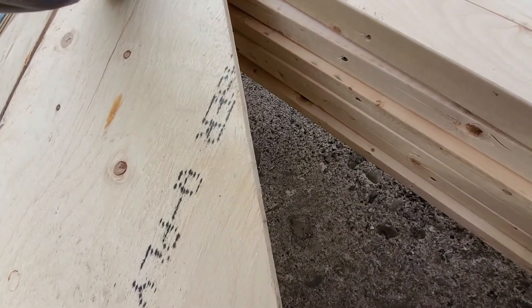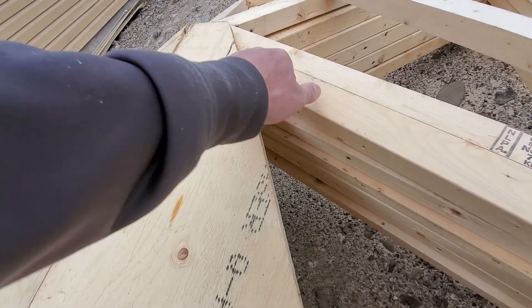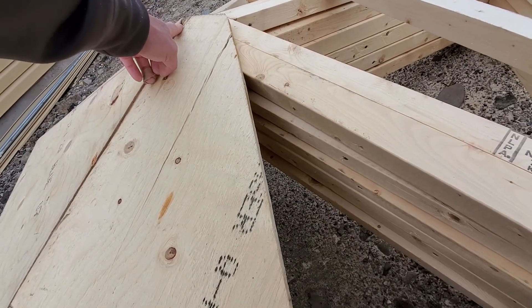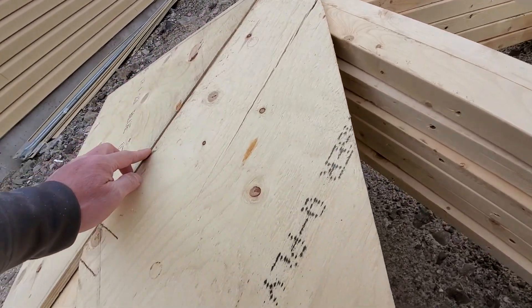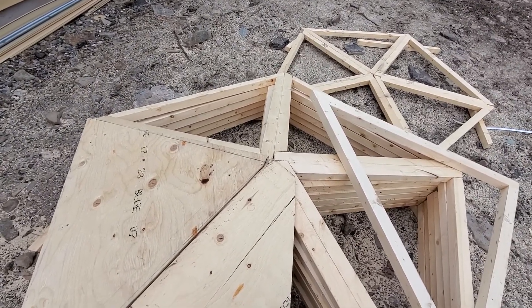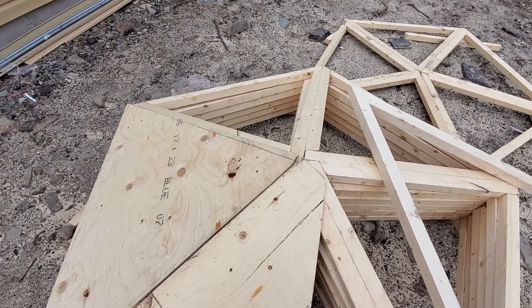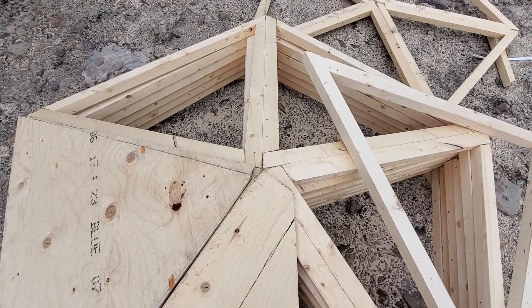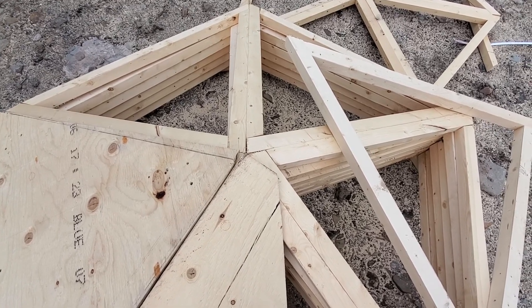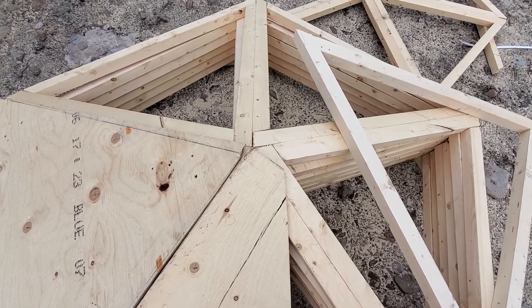According to building code, you want your decking to go flush on to the framing, which I can now do. I'm going to glue it along the seams here. I've got some weatherproof silicone caulking that I'm going to be running a bead down there, and I might get some speed tape to put over it — we'll see how far I want to take it. At the very core it might be interesting, but I can probably just put a big bead of silicone there as well. That should give it the flexibility it needs when it's working and shifting in the weather — heat, cold, and so forth.